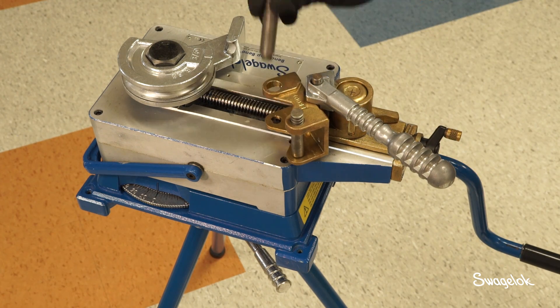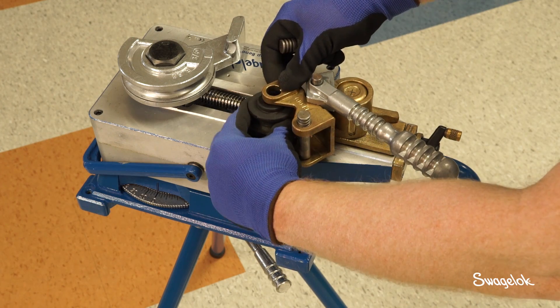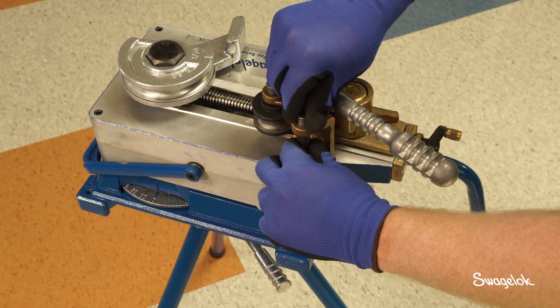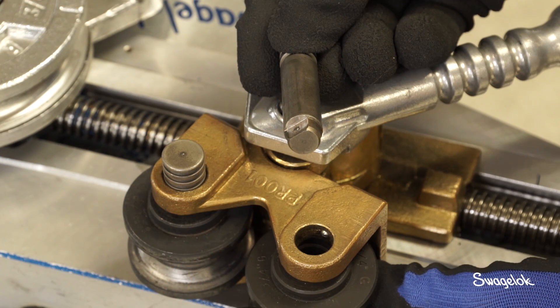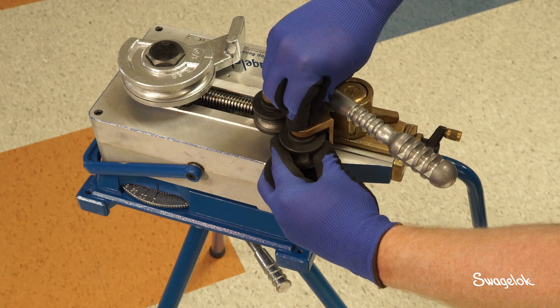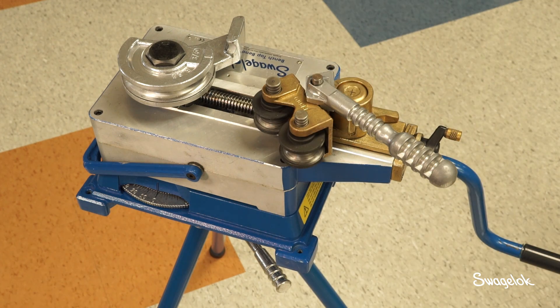Lift the roller pins. Place the appropriate G and D rollers in the marked locations on the roller bracket and replace the roller pins. The bottom of the roller pins has a flat ground into it and must be fully engaged with the roller bracket assembly. Turn the roller pins until they engage.